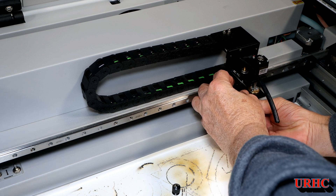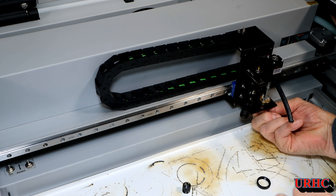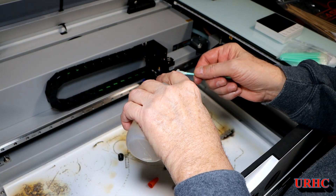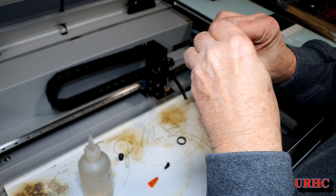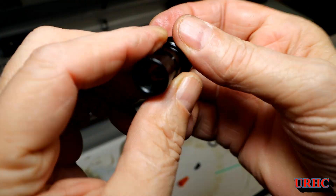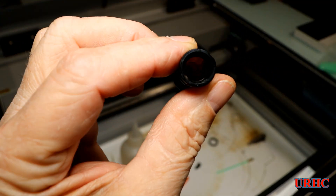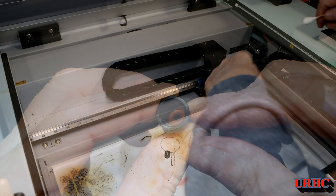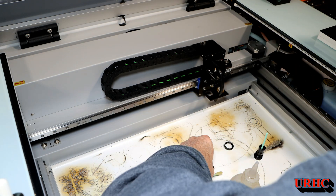To clean the lens, first you pull off the air assist tube fitting, crank down the Z-axis, and push the lens right out. I started with IPA alcohol and little swabs — you have to go up into the lens tube. I found out this is a specialized lens, not a standard lens; the whole thing is stuck together. Looking in there, there's a big black spot. It looks like the acrylic fumes got up inside and fused right into the lens material — it will not come off.